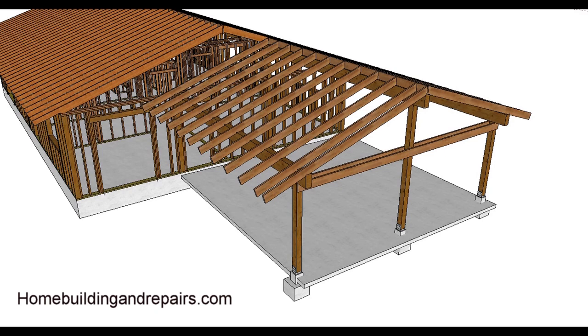This video is a response to an email. The individual wanted to know if they could do some modifications to a building and if it was even safe. What I would assume to be the original structure would be roof rafters sitting on top of a beam at the bottom, a ridge beam at the top supported by a post, and a beam on the other side with some type of post-to-post connection. That post-to-post connection looks like it might be doing something but it might not.